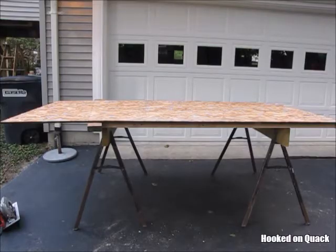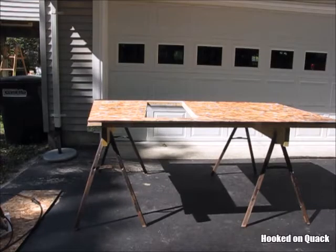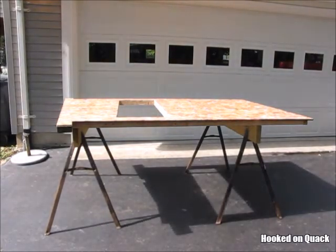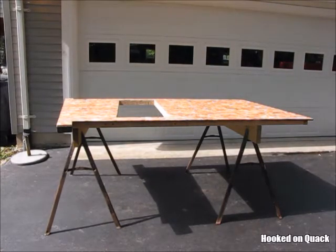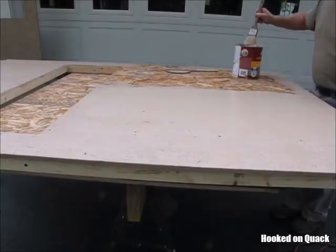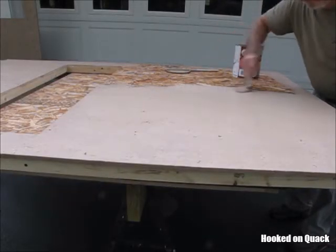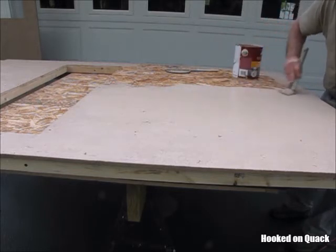I then cut the top edge of the sheathing even with the top of the framing and use the cutoff to fill in the remaining missing sheathing. I also cut out the rough openings for doors or windows in the panel. As alluded to earlier, a coat of paint is necessary to keep the panels weather resistant.